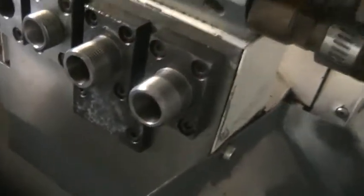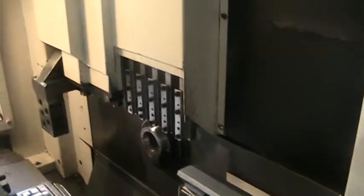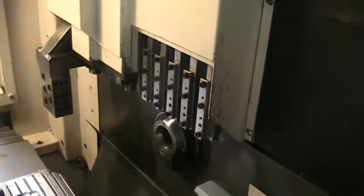These are all standard ER16s. Now we will go through the jog mode. This is the main spindle being jogged in the Z1 axis. This is moving in the X1, Y1, X axis. The slides are very quiet and the ball screws sound very good.